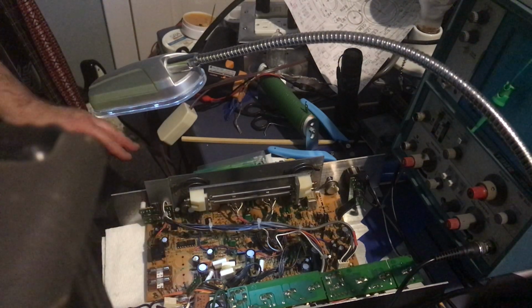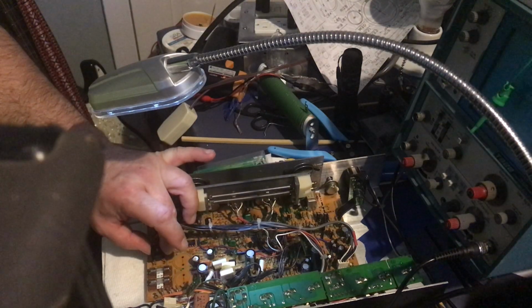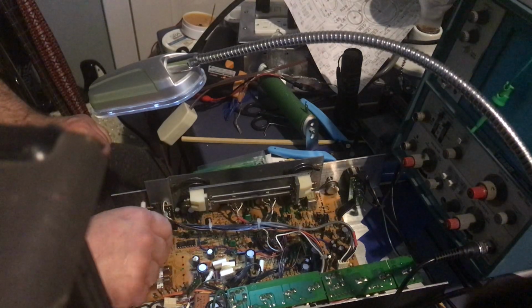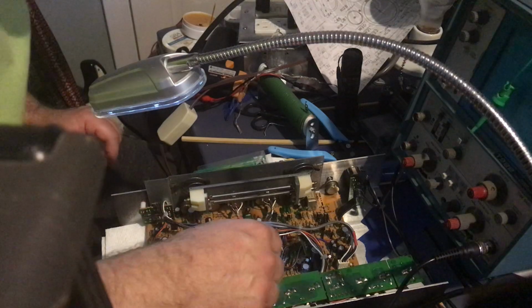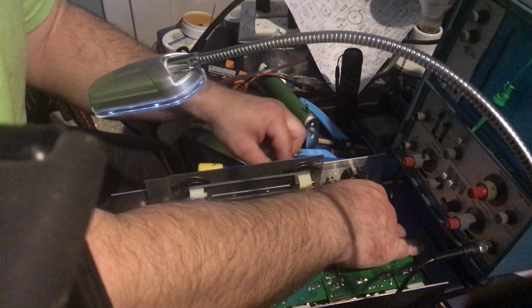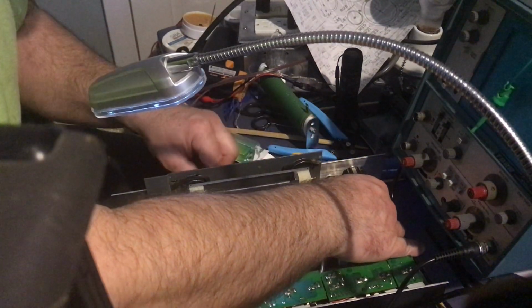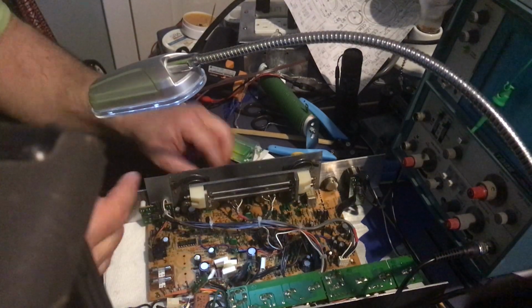Like I said, it's not a bad thing, I don't think. If you wanted, it gives you more room to bridge the diodes with capacitors, if you wanted a really clean signal without all that noise from the diode switching. So in that case, it's good.